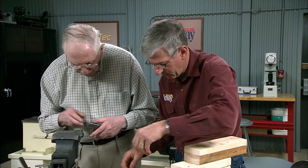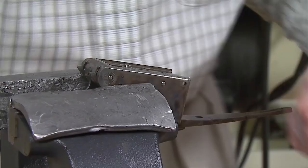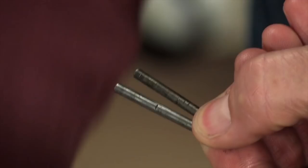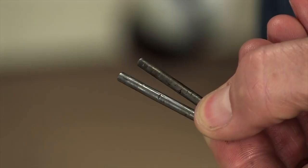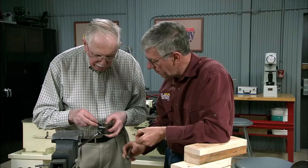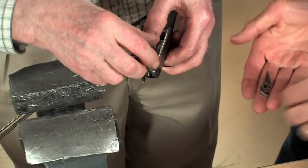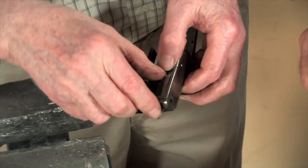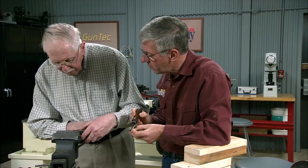The next thing is to take out your cocking lever pin. There we go — that's mark number one. There's the one on it, mark number one. Number two, the one that holds the sear on, mark number three. Take out the cocking levers. Very often one is marked with an R or an L. Usually the left — in this case it's got them marked with an R so you can't get those mixed up. An R there for right.